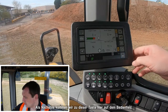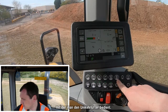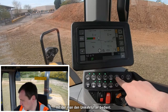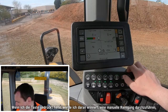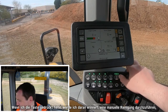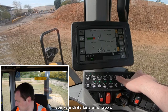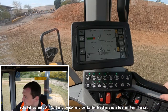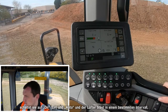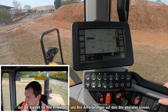This button here on the six-button keypad is your reversing fan. If I hold it in, it allows me to do a manual purge. If I press it once, it puts it into auto — so it will blow at a set interval — and we can configure that interval specifically to your application and requirements on the clamp.